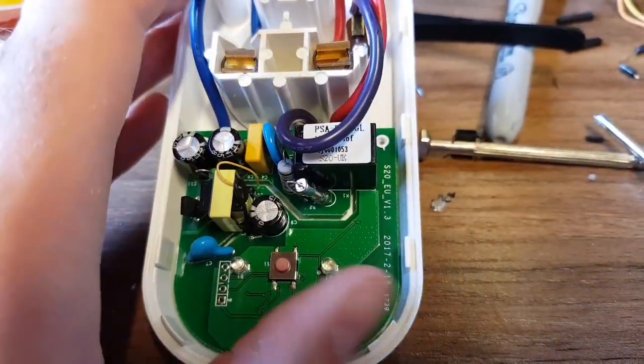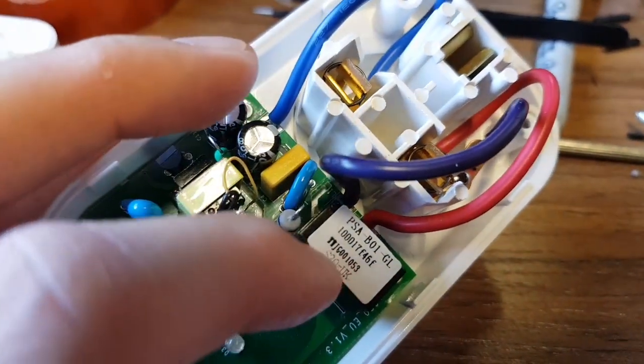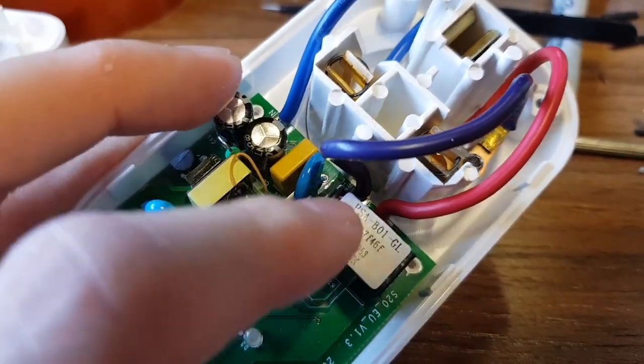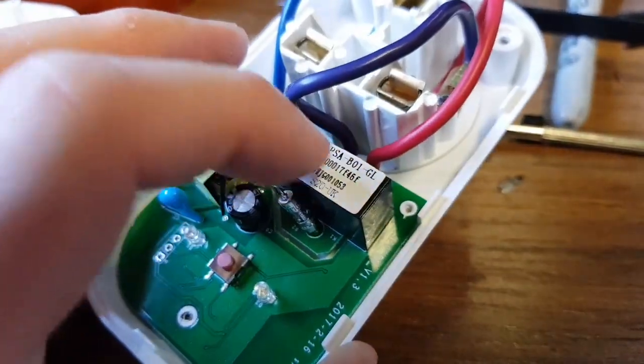If that's a bad connection it's going to heat up. You've only got a tiny little switching relay here. So any large inductive loads — that's going to cause it to weld closed, which is what could have happened to this, but there hasn't been any large inductive loads on it. Anyway, I'm rambling now, we'll take it out.